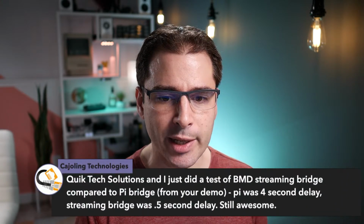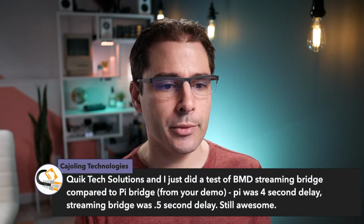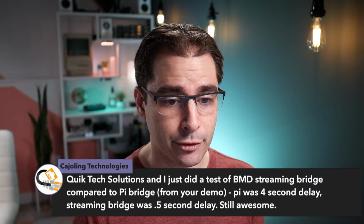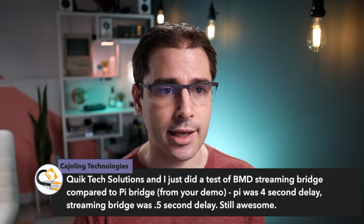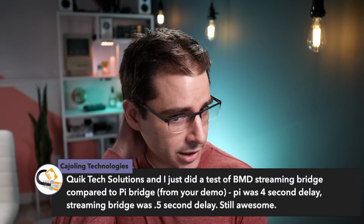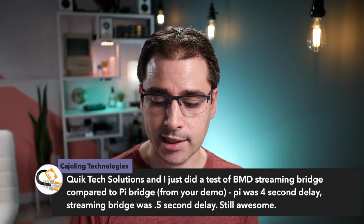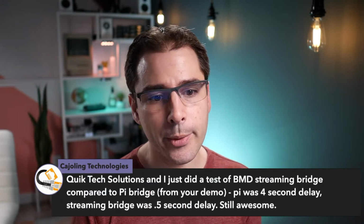Just did a test of Blackmagic Streaming Bridge compared to the Pi bridge. Pi was 4-second delay. Streaming Bridge was half a second delay. Yeah, and on Friday, I swear I was getting even less than half a second delay on that, which was incredible. They've done some magic there with the Streaming Bridge. But hey, the Pi bridge can accept RTMP from anything, not just an ATEM Mini Pro. But yeah, it is delayed.